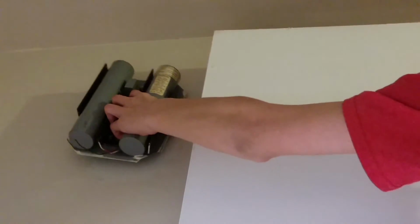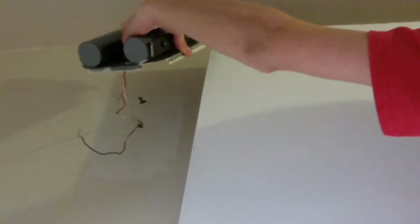Okay, well, I got the wires disconnected. You can see the red, white, and green wires up there. Green is to front, this one's to trans, and that one's to rear. So I will remember that. Alright, so now it's time to get the chime down. And luckily I don't need a screwdriver because it's just hanging on a nail, or it's got a keyhole feature on it. So I'm just going to simply lift the chime up and off that nail, and then just remove it like that. Now the old chime is down, ready to install the new one.